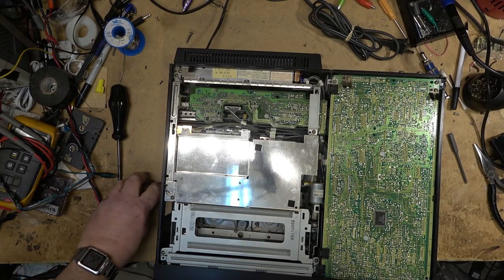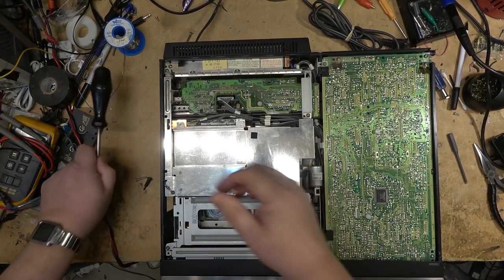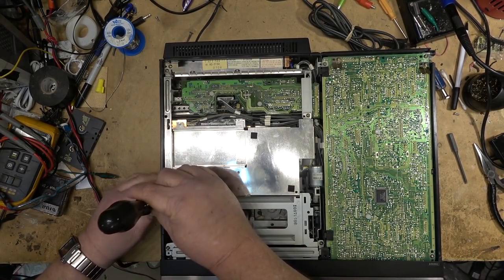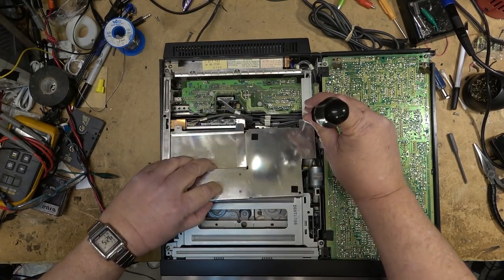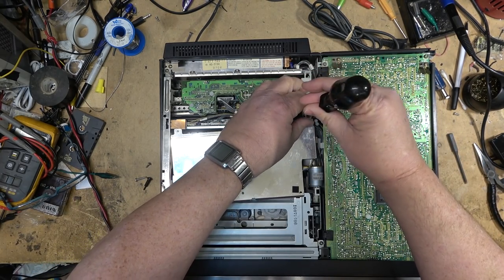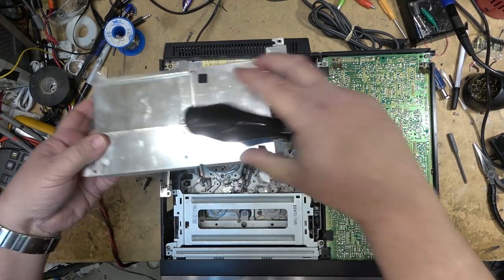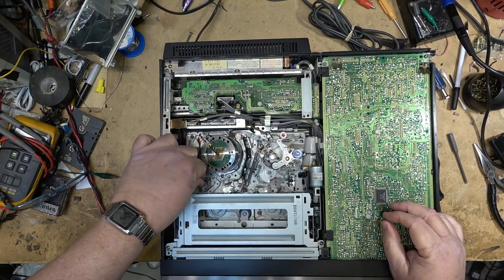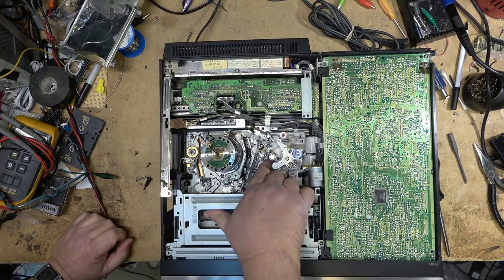The reason I want to open up the Sony before plugging it in and trying a tape is because I want to check that the tape guide is not jammed — a common problem on these SLV-R5s and all these Sonys. The P5 tape guide freezes, and sure enough, the P5 tape guide has frozen on this one. The blue gear is not broken, but the guide is frozen.